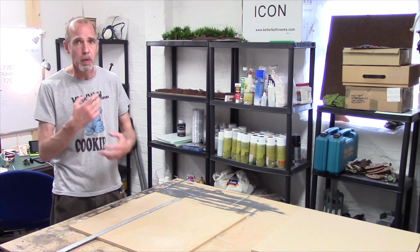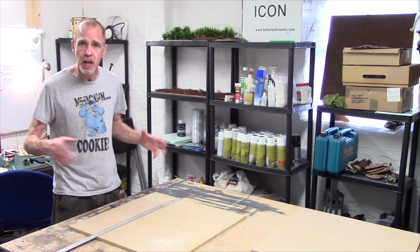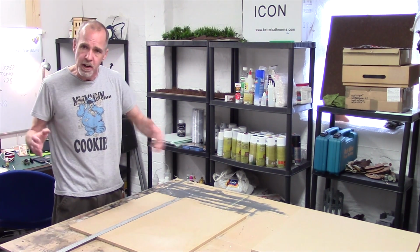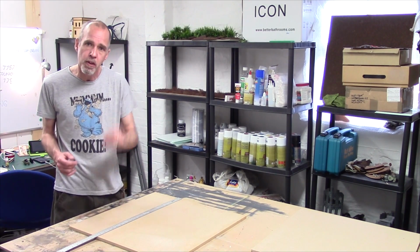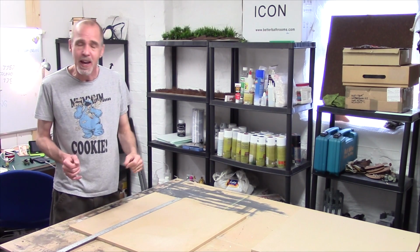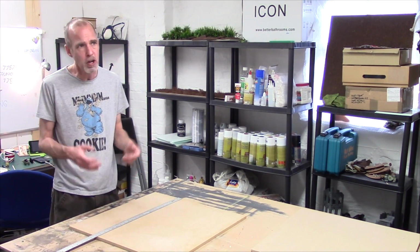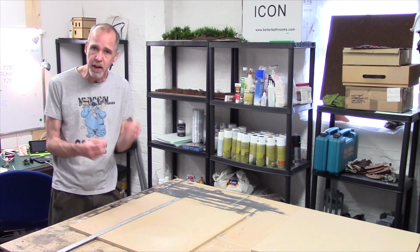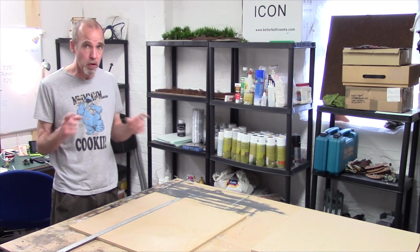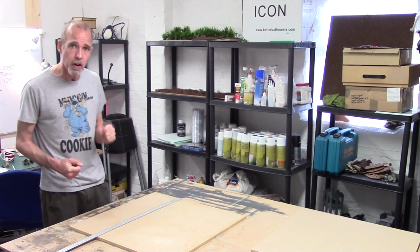This catches a lot of people out because everyone forgets about that blade width, and then they continue to build, and when they rack it all up together and put those pieces together, those little 3 mils all build up, and over 3 tiles you can lose 6 mils. On an 8x4 you can lose 9 mils, almost a centimetre, and end up with gaps in your layout. So that's one of the reasons why my boards aren't 2x2. Instead, I go for a smaller option.